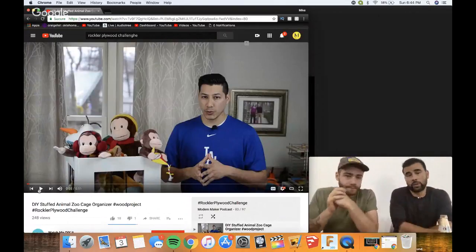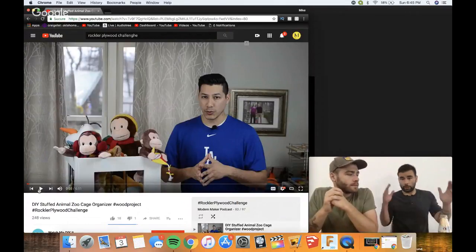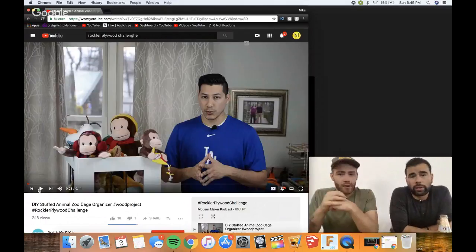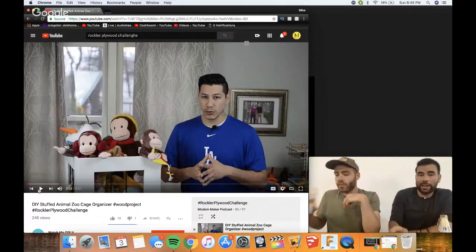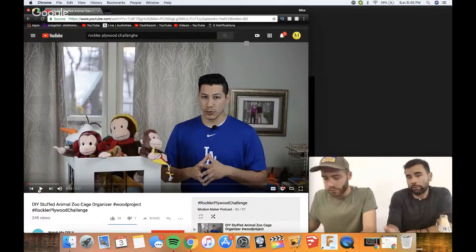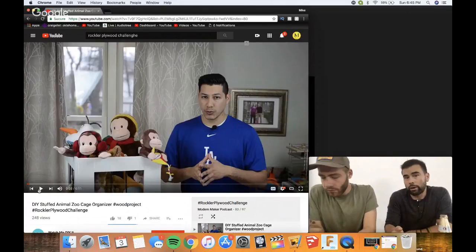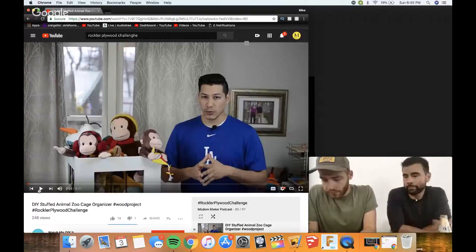Yeah. So the geometric lines have been hot for a minute. I think they might be on their way out in the next couple of years, but you'll see West Elm and all those places take brass inlays, that sort of random geometric thing, over a console table front or a dresser. So we've been experimenting, and instead of inlaying material, we've just been using fusion grout that's for tile in bright white. It looks like white concrete. It's so strong you can even, after you do the inlay, cut it with a saw, and it doesn't chip out or fall apart.